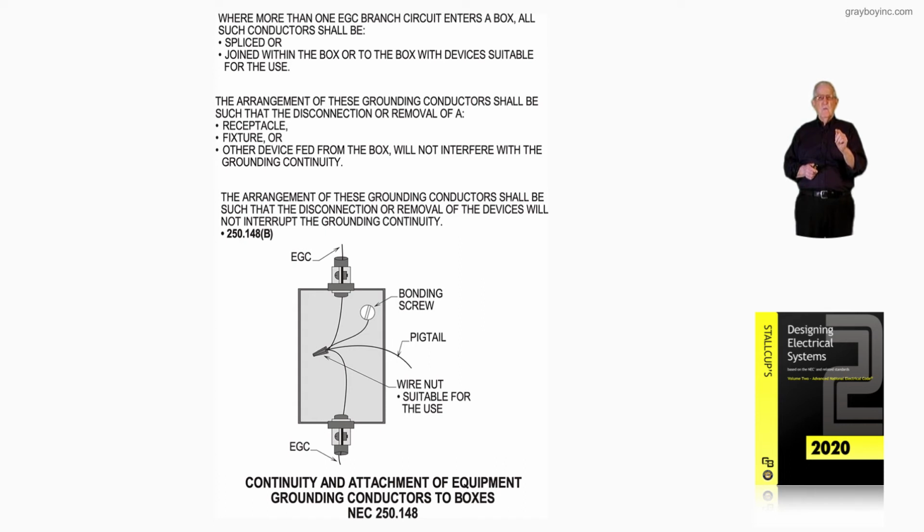And 250.146(D) allows that. Now, if you had a sub-panel that was between the service equipment and this receptacle, then 408.40 exception would allow you to pass through it. You could splice the wire, just pass through it, and it wouldn't have to be connected to the metal.